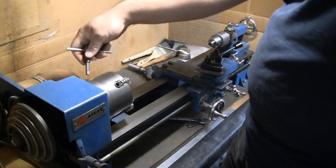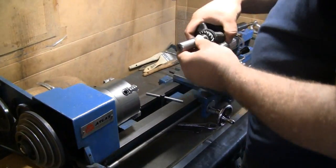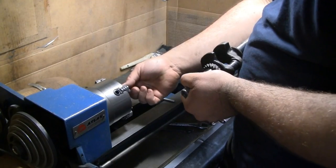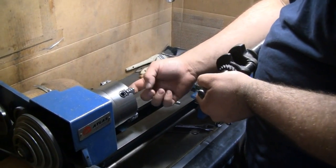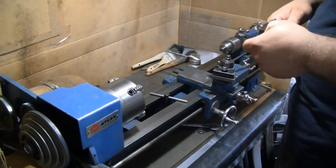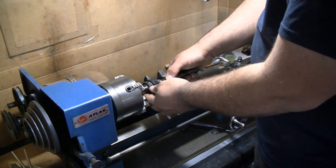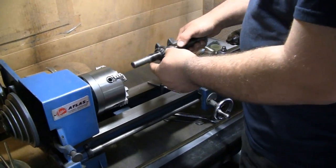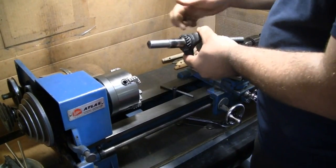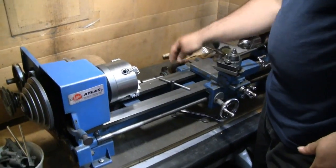Right. So we're ready to put the crank in, but one thing we want to do, because these jaws are probably hardened, and they're ground, and they have, I don't want to say sharp edges, but they're finely ground. They're crisp. Yeah, crisp edges, that's a good word for it. You had some. I did. Let me find some flashing or something, right? To just wrap the bearing surface on the crank with, and then we can tighten it down. It doesn't matter if the jaws are all the same distance from the crank, because we overlap the sheathing. We'll just put the dial indicator here and make sure this is running true. Okay, let me find that flashing for you.